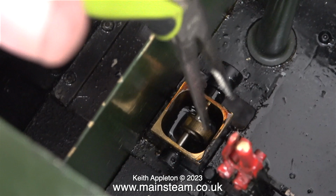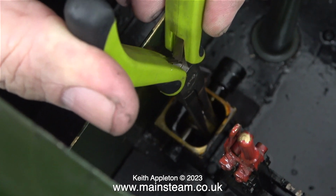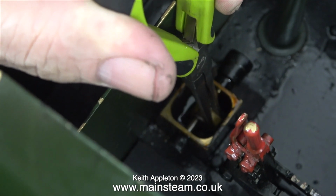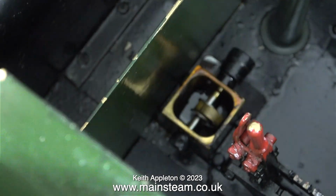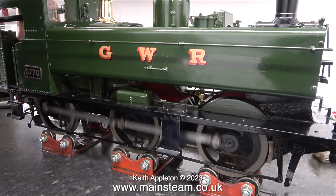I'm sure this middle bit of the pump is supposed to go round. The question is, what is the problem with it? This lubricator is of the Sprag clutch type. A special clutch that grips the shaft when you turn it one way and doesn't grip it when you turn it the other way, so it acts a little bit like a ratchet.